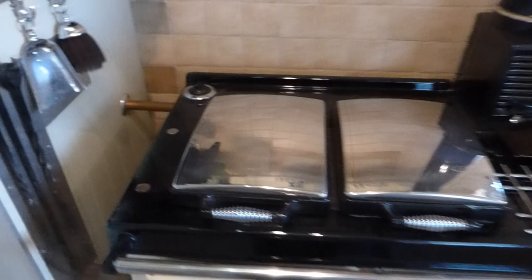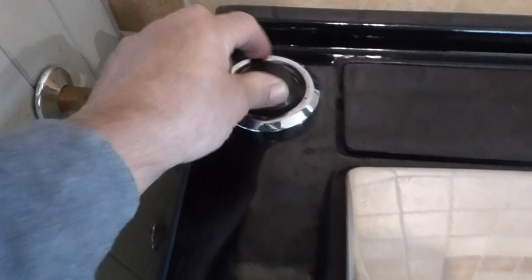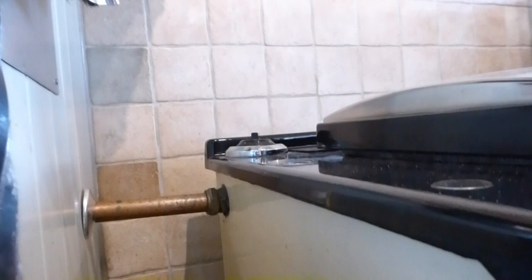Up the flow pipe - you can balance it down with your dampers. When you start, pull that right out and open your air to get some air going through. If you've got a newer model, this is a 355, some come with a stat at the back. This is a heating control for heating only, nothing to do with the cooker. You can adjust it to different temperatures - the higher you get, the more air is let in. It comes in through this little louvre vent, linked to a flap inside that opens and shuts, letting air travel underneath, up through the flames and through the coal.